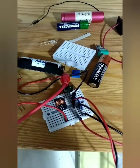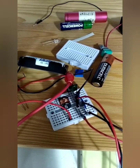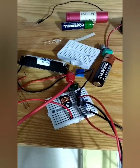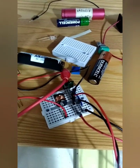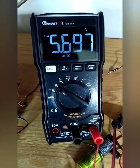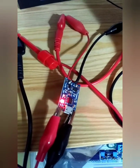Use only a small capacitor — don't use a big one, because I've fried some LEDs and a TP4056 charger unit by doing that. I think what happened is the capacitor discharged very quickly and just fried the board and the LED. So be very careful with that. As you can see, the voltage coming out to the board is 5.6 volts. Here you've got a typical lithium-ion charging board, and you can see it's charging.